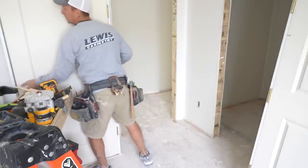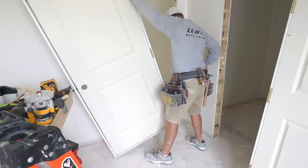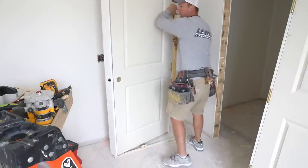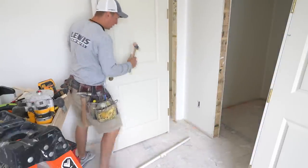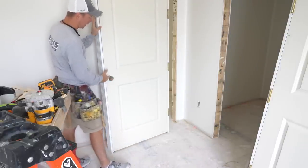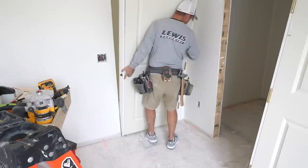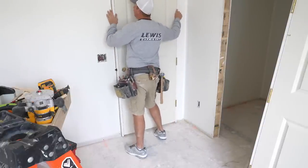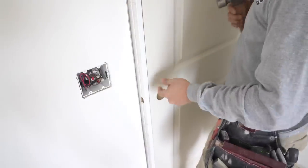Manhandling these big boys can be a little fun. First thing we do: tilt it over carefully, kind of use your leg to stabilize it, and knock off this brace on the bottom that they use for transit. A lot of times you'll have the little door latch stopper here — I leave that in until I get it in the opening. So I've got the door loosely pushed in the opening. This is where I'll take my hammer claw and pop that bad boy out.